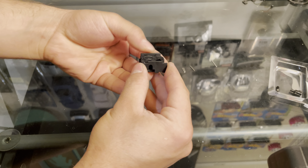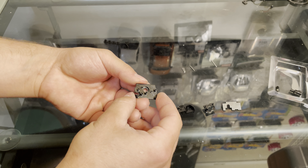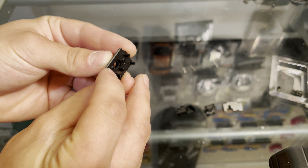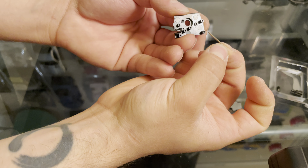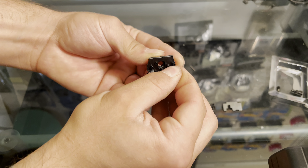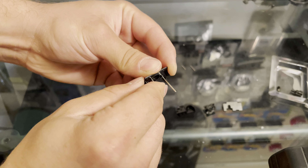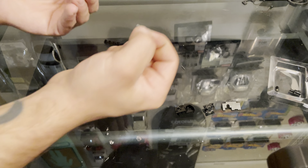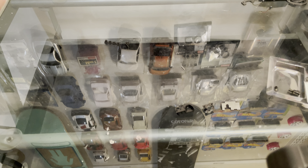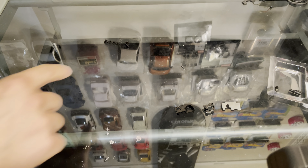We'll take the servo, disassemble it, and put it together plate by plate. The pins go in the short pockets. We'll start with the long pin — the long pin comes in the servo saver set, so you have to buy both sets. The long pin goes on the very left driver side. Take a short pin and it'll go right next to where the servo motor is going to go, right in the middle, and then you'll take the medium pin and it'll go right here.